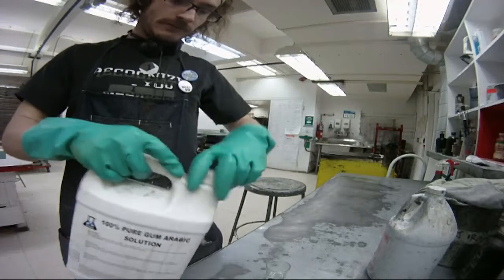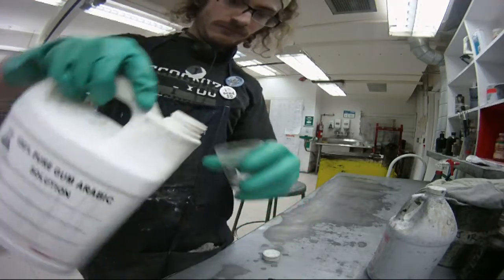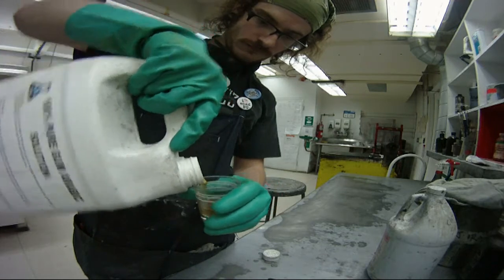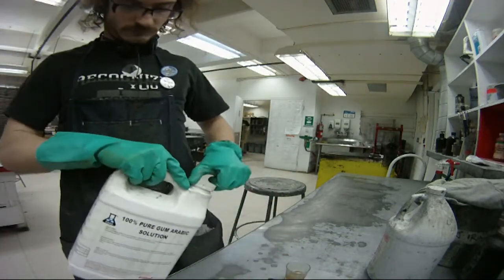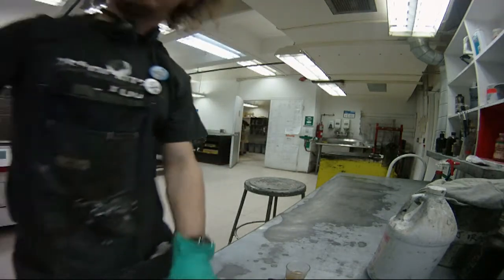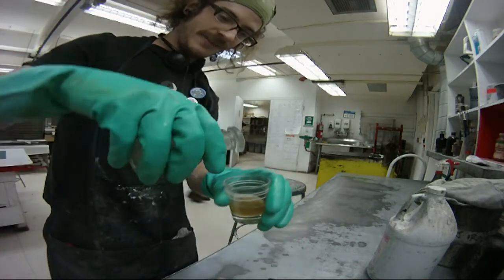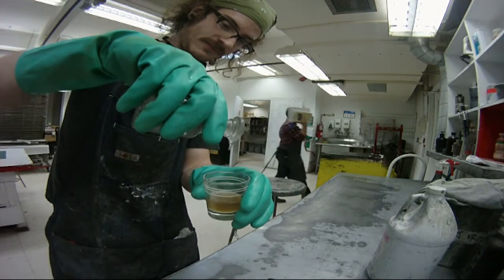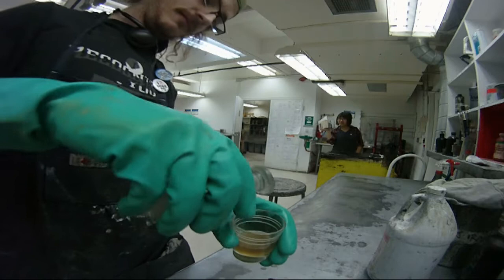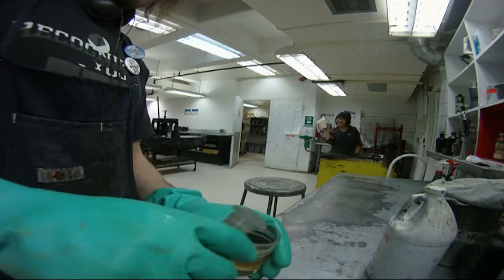I also like making a hot etch. We have an excess jug of hot etch, which is pretty much leftover gum from when you're spot etching. I usually throw some of that into a shot glass and add maybe 10–15 drops of nitric acid — nice and spicy. That will help remove any excess ink that seems to roll up in water-loving areas that we want to get rid of, and it'll help stabilize it.